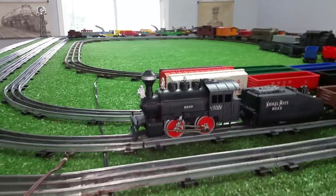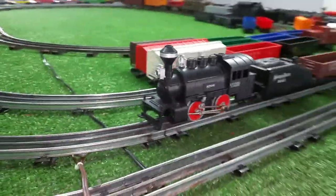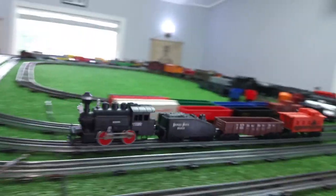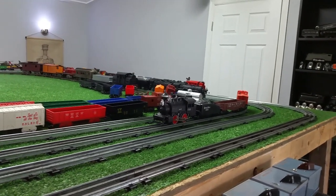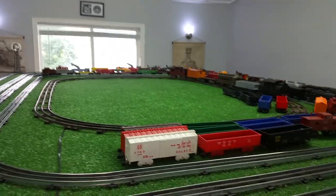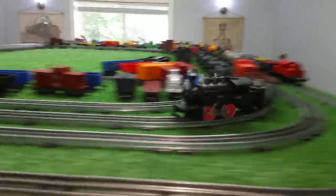In this case, you just add a simple diode to the transformer. I will pull this apart — it has a can motor in it — and solder a diode directly onto the motor, and from then on it will run on AC. Now, the thing about this is you can just reverse these wires and it also reverses direction. So if I wanted to, I could put a switch in there and have forward and reverse. But I'll very likely just leave this as a forward-only locomotive. It's got an eccentric and a valve on it, so it actually looks pretty good.